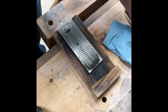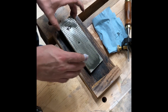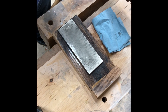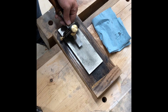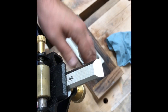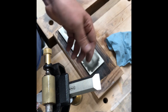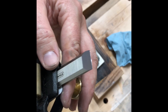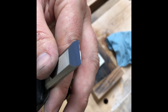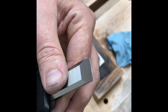Let's get the stones flipped over. Be very careful setting down your chisel — you do not want that to fall and hit the concrete. Wet down the thousand side and do the same thing over again. Every time I pick it up and check it, I'm counting to 20 seconds — you probably don't need to go that far, but that's what I've chosen. When I go to the higher grits, it'll be more like 10. You can see we're taking quite a burr off there, and we are getting pretty slick right now. Time to move up to the wet stones.